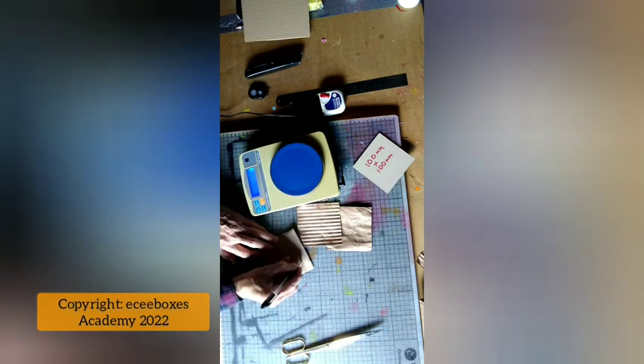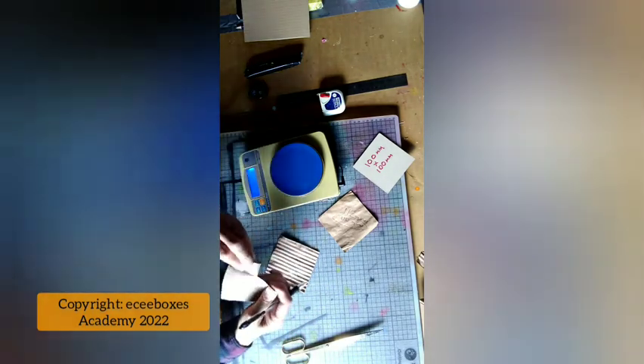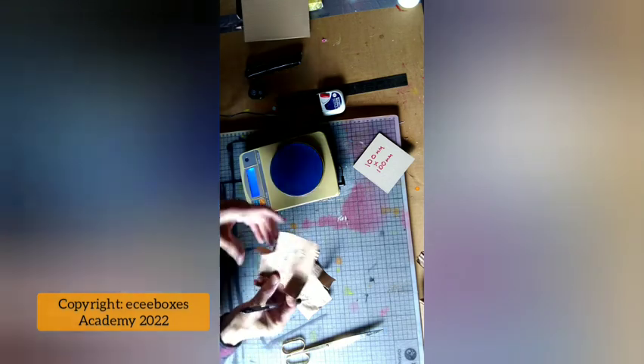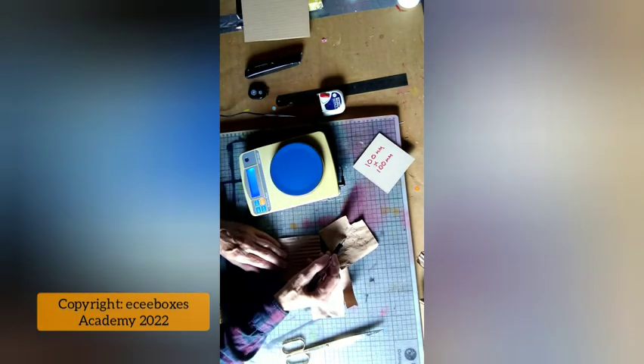Make sure no paper is hanging off as that can affect the weight. The inner liner settles at 1.04 — so that's probably also 100 grams per square meter. They're all recycled paper; if you just tear it you can see it's made out of mixed fibres. This looks like kraft but it's actually a fake kraft. So this board was: 110 GSM outer liner, 100 GSM fluting, and 100 GSM inner liner. That's how we determine the board grade using the soak test.